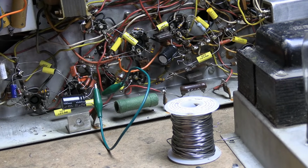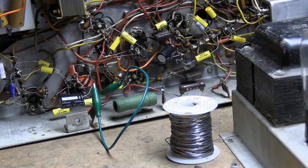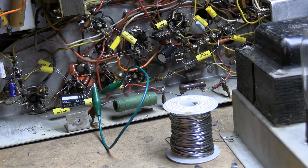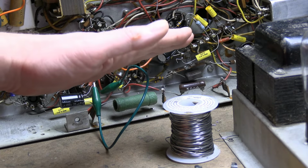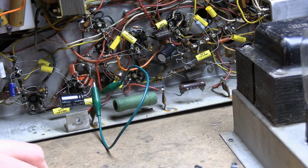It's like with a lot of things, the last 5% takes 95% of your time. It's often no different with this stuff. What I'm more inclined to do, rather than to keep going over this and clipping out these resistors, which are all pretty close within spec, I'm more inclined to finish up the rest of the set. I did finish recapping, I think, the horizontal, with the exception of there are still one or two original mica caps, which I'm inclined to leave in for now.